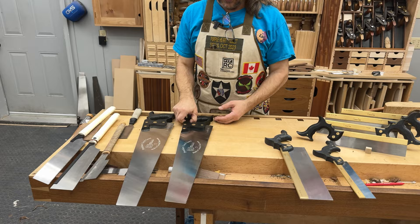Around 2007, I got the idea that if you were to take little tiny teeth — easy to start — and combine them with big teeth, which are nice and fast, you'd come out with a saw that has a little starter strip right at the beginning. This is one of the very first saws I actually made — a handle made out of Corian. I went in and filed that first inch and a half with fine teeth so you could come in with very little sawing resistance, get it started, and then introduce the big teeth to get your speed. I decided to make my own saw, increase the length to compensate, and add a heavier brass back — balanced so the weight of the saw does the majority of the work.